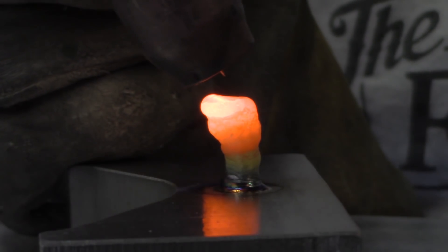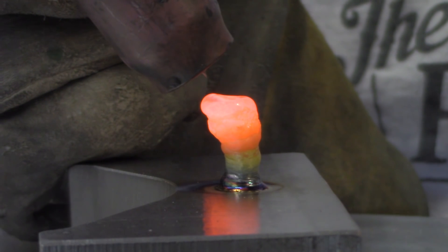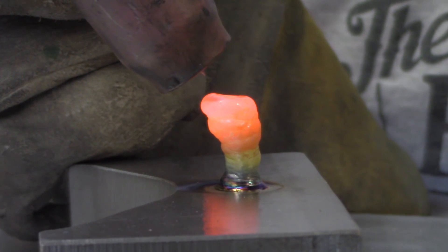Once you have a couple of blobs laid out, you are going to start making circles and those circles you are going to increase the diameter by welding on the outside edge of the circle each time that you go around it. Just work around the outside of it, keep going around the circles, and make sure you take plenty of breaks to not let your metal get too hot because once it actually gets hot, it is going to start slumping.